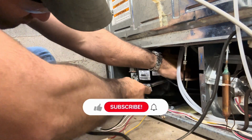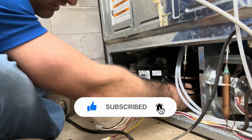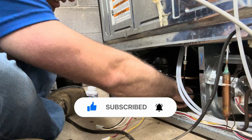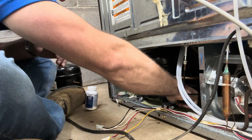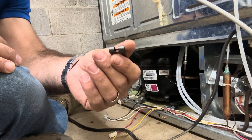Finishing our last bolt here. The compressor is triggered by low voltage, and the constant 110 is always there, so if I put 110 straight to the compressor it would just freeze and freeze and burn the compressor out.